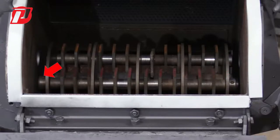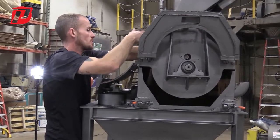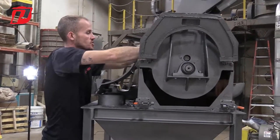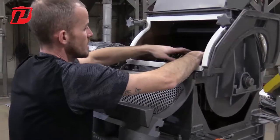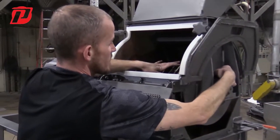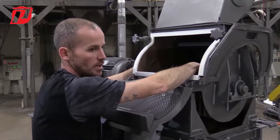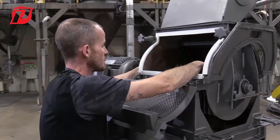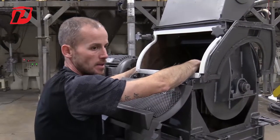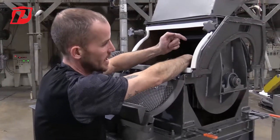So if I go to change the hammers, I'm going to remove this lock collar. If we're doing it in this aspect, we're going to want to loosen the drive side lock collar. Once that lock and collar is removed, I can simply go ahead and start pulling. Sometimes on this side, what you might have to do is use a dowel pin or a screwdriver to get it into that slot that's machined out for that pin to fit in, and you might have to tap that pin a little bit that way.